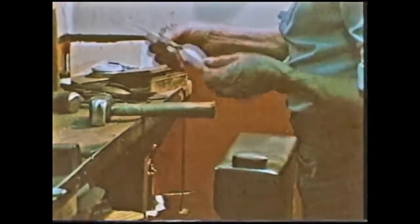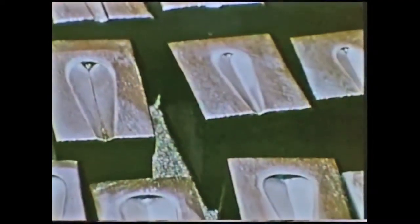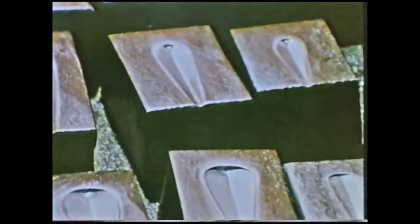The next operation is then basically to go back to the forge, where they are hammered out to a set length which is usually just under the finished size. So they may be roughly 1/8 of an inch under the finished or completed size. The stamper then gets the article back and puts whatever pattern is required on the top. In this case, it's the rib rat tail pattern. So he puts the rib rat tail pattern onto the piece of silver.